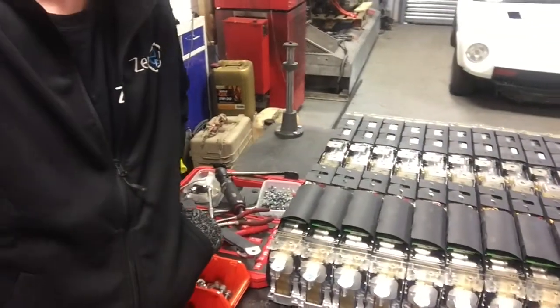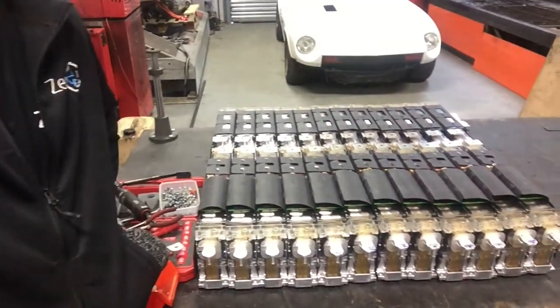We're going to build a battery box today — 12 modules, smart car style. The modules are just here as you can see. We're going to knock up a box section battery box using 3mm 25x25 box section, tap it out so the modules just bolt straight in, and then we're going to look at doing the wiring on another episode to put all the contactors and the battery management system in.